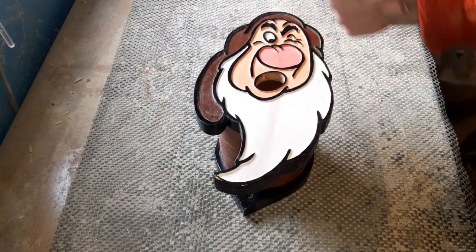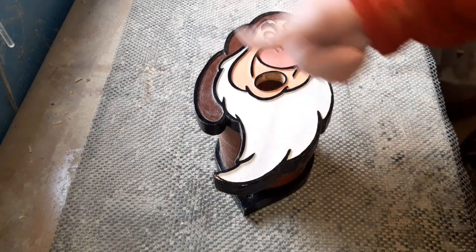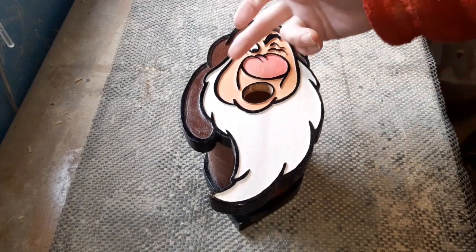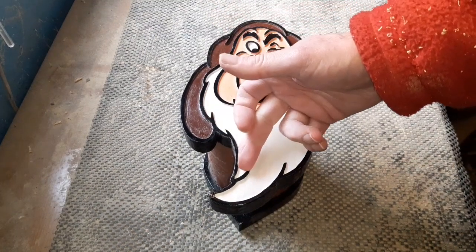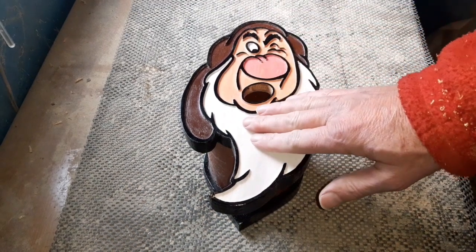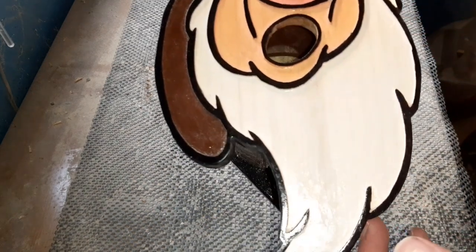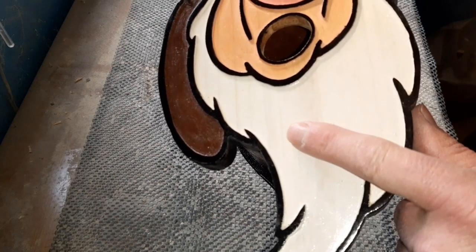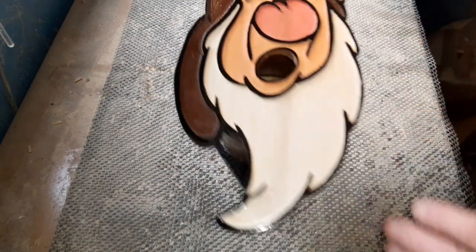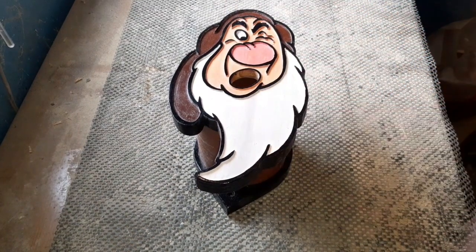So it's a grumpy bird box. It measures in at 10 inches by 6 inches across. We routed it out on rough fencing wood using CNC bits for the lines and our end milling bits to clear it all out. We then painted on acrylic paint, diluted nicely so it's more of a stain. And if you look closely, you can more or less just see the grain of the wood. So let it soak into the wood, more so than put it on too thickly. And then I give it a quick spray with a little gloss just to finish it off.